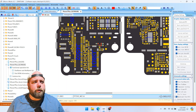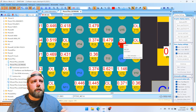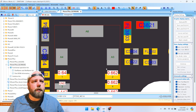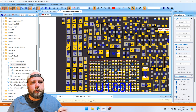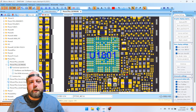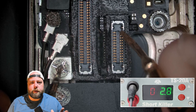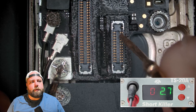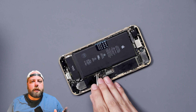Here on the smaller of the two display connectors is where the home button is connected. We can see that this line going back to U14, which is supposed to be an open line, is supposed to provide three volts. When you put it in continuity mode, you're going to get something around 600 ohms. But what we're finding with the multimeter is near a short — it's not fully shorted, but there's definitely an issue. When we check voltage, we're testing with 2.7 volts and not getting the proper voltage reading.